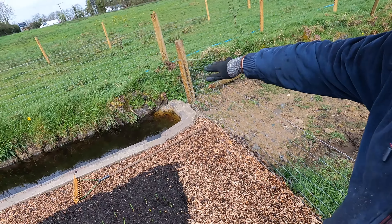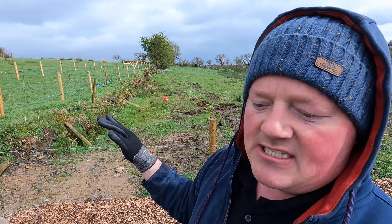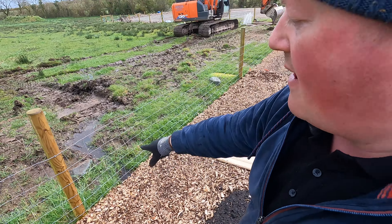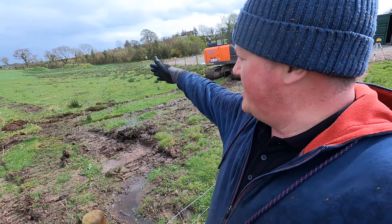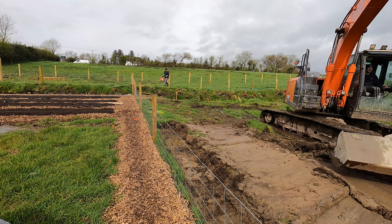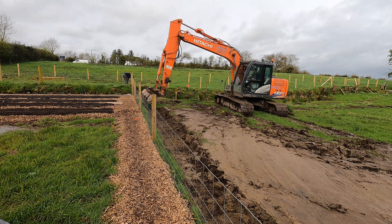Water is still leaching out of this pond. It's only doing it slightly. It hasn't properly sealed, I think. Even if it hasn't, whatever — it's still holding water. But the water is coming out through the wood chip. I originally, because this was such a wet hole of a place, cut a wee track for the water and it's been trickling down through the middle of the field. So I'm asking him to just peel back a foot wide, six inches deep — that'll direct the water running out of the pond into the field drain.